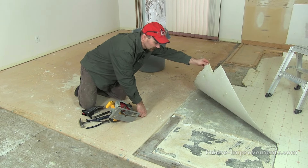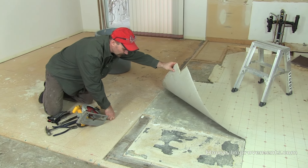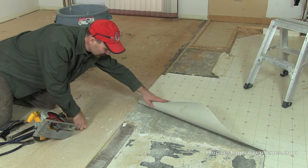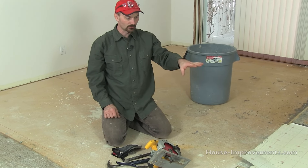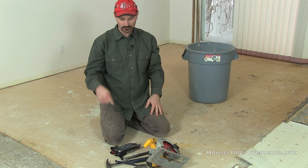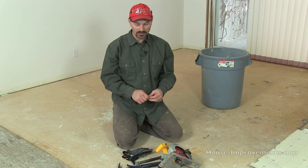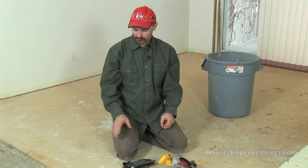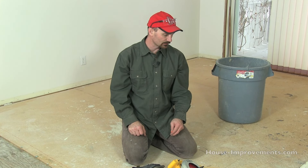Most times vinyl flooring will not just lift off like this — this one must not have been glued real well. Most times you're going to be scraping and scraping, and it's just easier to actually remove this all in one piece. You can do it whether there's vinyl over top of it or whether it's bare. This type of material is usually stapled and nailed, or it'll be a combination of both or one or the other. This one's got a few tack nails — they must have laid it down, tacked it in place, and then somebody came along with the stapler and stapled it.